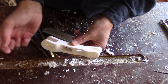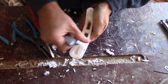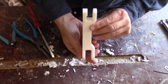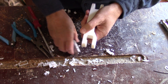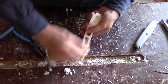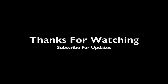These hairs — you can take a flame and just lightly go over there and burn them right off. You can also try to scrape them off very gently. If you have a lot of them, it's easier with the flame. This is pretty clean — we've got a really good surface. It needs a little bit of touch up here and there. Some coarse sandpaper works pretty well to take off some of the bigger imperfections, and then you can work it down to finer if you desire. So that's how you do it — you can take even a fairly complex part and work slowly and patiently with the right tools and remove those supports fairly easily.